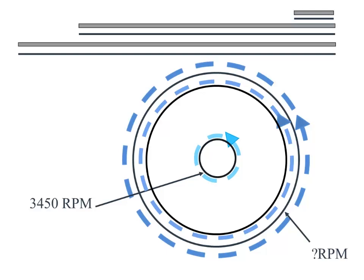Now you can change the velocity in a few ways by changing the radius. One is by trimming the impeller or cutting down this radius. This will lower the velocity and thus lower the energy. The lines above the impeller are an attempt to show you this relationship. The greater the radius, the higher the velocity. You can also trim an impeller by damaging it. This is done by cavitation damage accidentally, and again affects the velocity of the water, thus lowering the energy in the system. Another way to change the velocity, though, is by RPM, and that is for a different discussion.